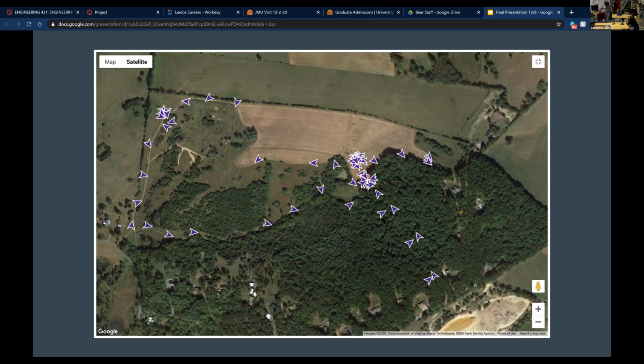Dogs don't always face in the direction that they're running, so the head's probably going back and forth. Yeah, and sidestepping too. I wondered if he was kind of looking over his shoulder. Second of all, the compass is technically supposed to be exactly parallel to the surface of the Earth to get correct readings, and that practically never happens. If the collar is picked up at a certain degree, the magnetometer is offset by a certain amount, which is not at all being accounted for. It just looked a little unusual. I didn't mean it to be a challenge.